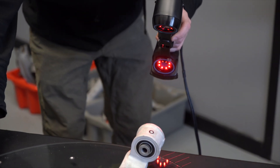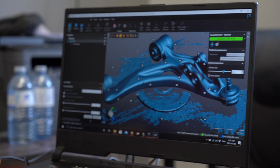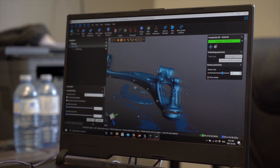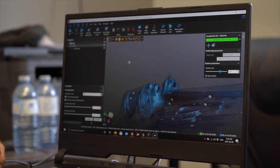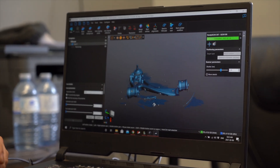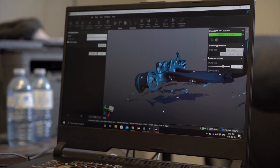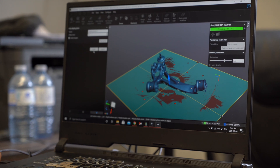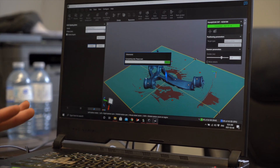We're just about done with the top scan. I'll flip the arm over and show you how it all goes together. I've got my first scan — the next thing I need to do is render it. You can see the whole underside is not picked up and there's a lot of scatter geometry from the table. To delete all that, I can create a plane by selecting some points and delete everything below it, leaving just the part.